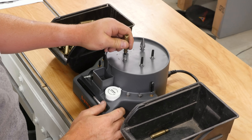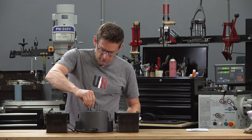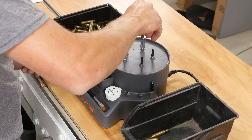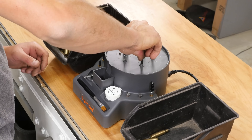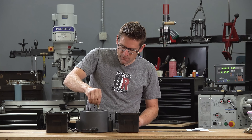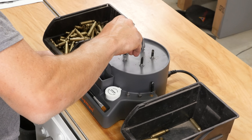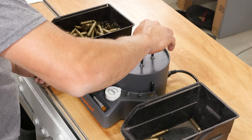Now with the brass oriented one way, we brush, then outside, then inside, then flip. Got to feed this a little slower — there we go, twist. That's a better flow for sure. Slow feed because we're reaming — that's much better. Then clean. What's really nice about this tool is that gravity takes all of the shavings and they just fall right down out of the particular station we're using and out of the case, landing on this large built-in tray.